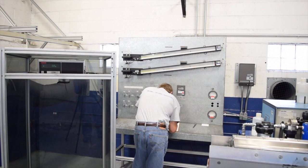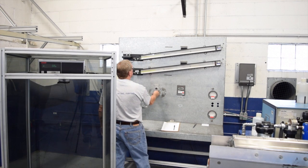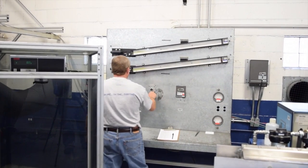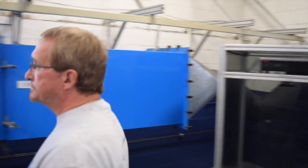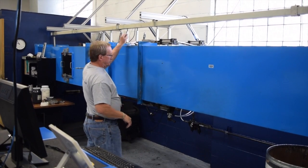During an air filter test, the most critical part is determining the right amount of airflow. In an ASHRAE test duct with a calibrated nozzle — in this case eight and a half inch diameter — this manometer is used to determine the pressure drop across that nozzle to guarantee the exact airflow. This manometer is used to measure the pressure drop across the filter being tested.